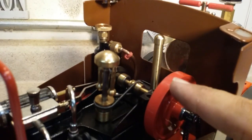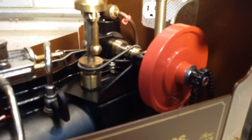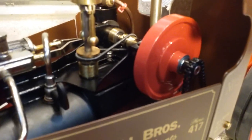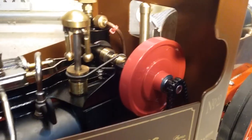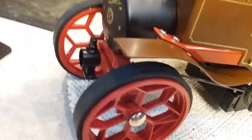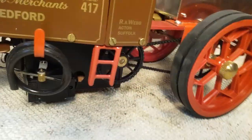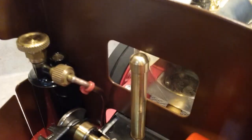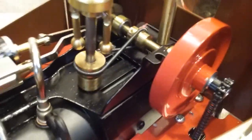It runs through two rollerball bearings and a number 4 metric plug — that's just a plug in the boiler. All that was was a hold-down screw for that plate, so I replaced that and now we've got something that looks like a governor there. One of the more important things I did — every shaft in this except for the front axle — the drive axle, the jack shaft, and the main shaft drive shaft back there — all have rollerball bearings in them now. I drilled out and removed the lugs that were in there and replaced them with sealed rollerball bearings.